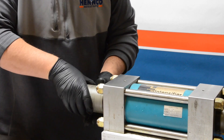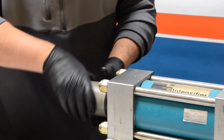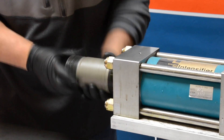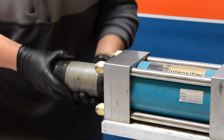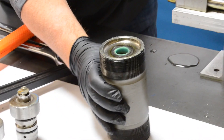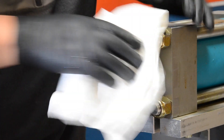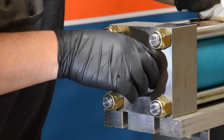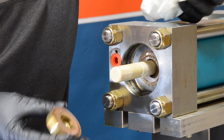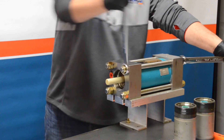The knuckle wrench also helps when cylinders get a little stuck in either the end cap or the high pressure end bell. Make sure to support and gently slide off the plunger — you'll see some water because this intensifier was in use at a customer site. Once done, set aside the cylinder and remove the backup ring. Clean off the plunger, ensure there's no debris, and slide the backup ring off. Inspect the ID for any uneven wear. Typically these are not good to reuse, so go ahead and throw them away.